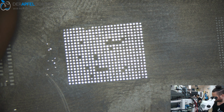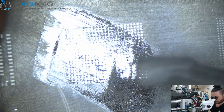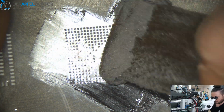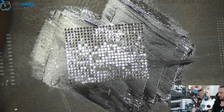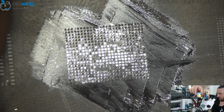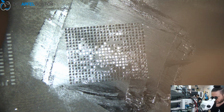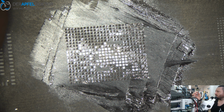Then just take a little bit of solder paste. I use the VL 183 or the PPD 183. In this case I use the VL because I got it next to me. Here it's that paste, but you can use the PPD too. Normally I only use PPD 183 for all the reballs I do. Get the paste in the stencil, and then you need some tweezers like that.